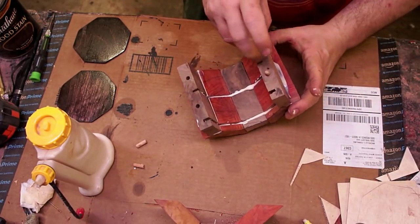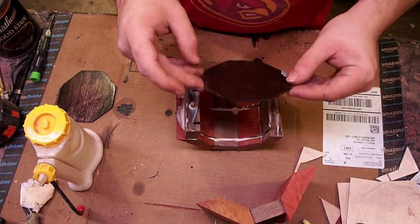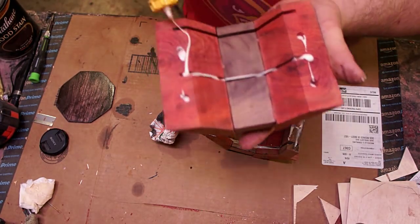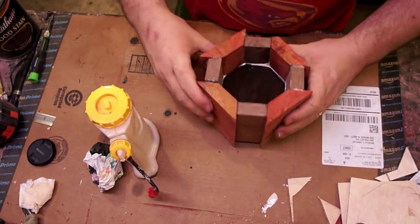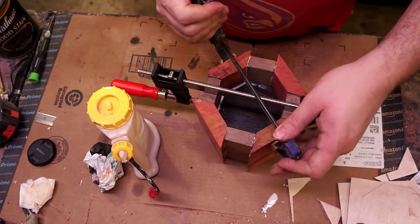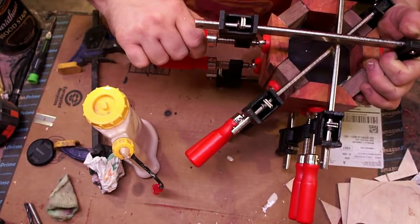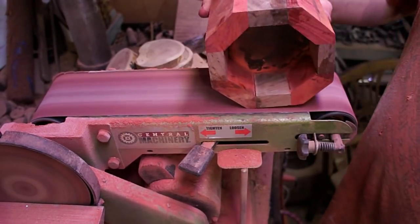I put all the little dowel pins in — I ended up having to cut them in half just because if I'd kept them full length they would have gone to the edge of the red heart, and I wanted to make sure they weren't poking through after sanding. I've seen some people leave the bottom panels free-floating in the boxes, but I didn't want to do that because if they moved around — and I did cut them a tad small — you could potentially get some leakage around the bottom. As any woodworker knows, you can never have enough clamps. The mating surfaces weren't quite straight so I had to put clamps on from all kinds of different angles to make sure everything came out as tight as possible.